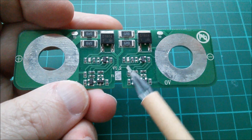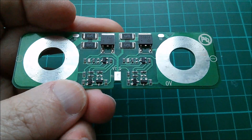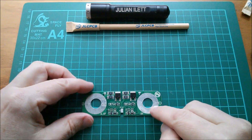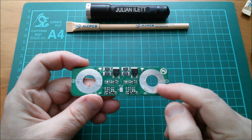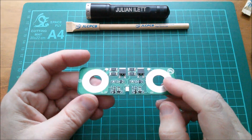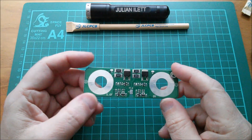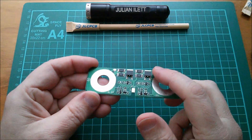So yes, we would see when this circuit kicks in and whether this LED gradually fades up or just switches on suddenly. That's not a MOSFET — it's bipolar. The holes in this board are absolutely massive, probably 12 millimeters in diameter. This is for 3000 farad supercapacitors — 3000F is in the title of this device. They've got these very big nut and bolt arrangements on the end.